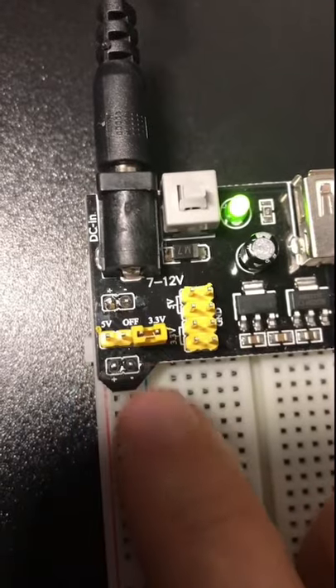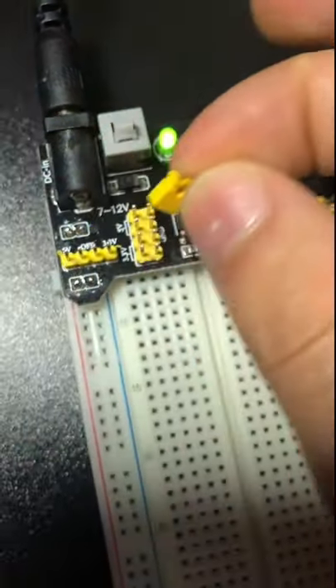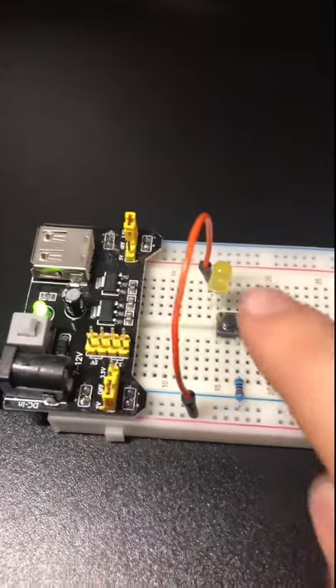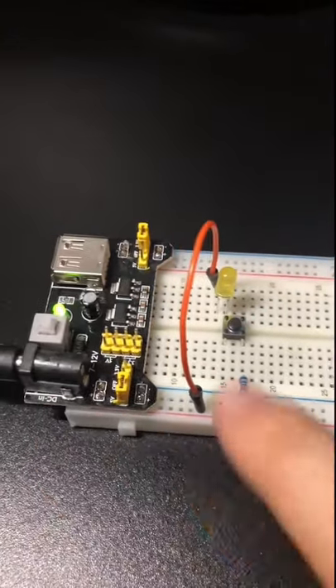You can also choose how many volts you want — you can get 3.3 volts or 5 volts, and you can do that for either side. So let's make a quick circuit here just to show that. We have 5 volts connected and when we push that button the LED turns on, just as we expect.